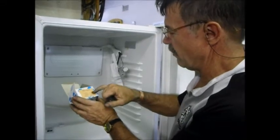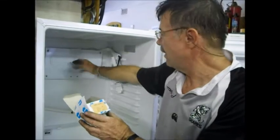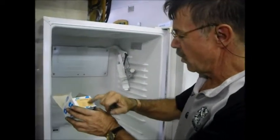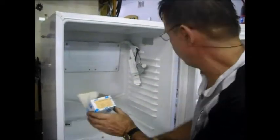This difference, minus 26 to minus 11, is quite a big difference. What we find is when this plate gets to about minus 18 degrees, the temperature in the fridge is about plus 4, which is a perfect temperature — smack bang in the middle of that. But every now and then we find there's a problem with the settings and we can recalibrate this.